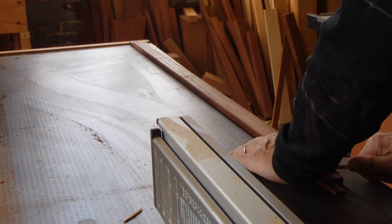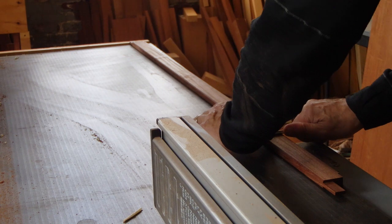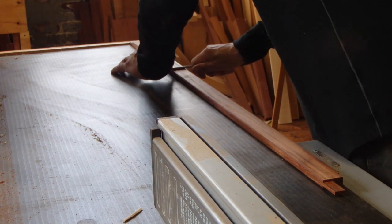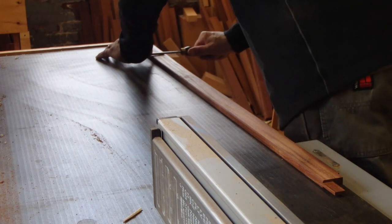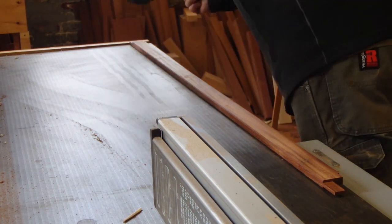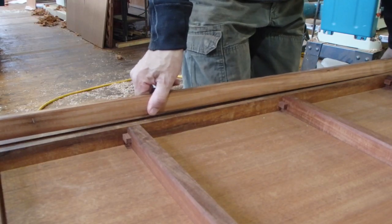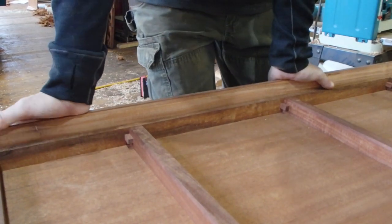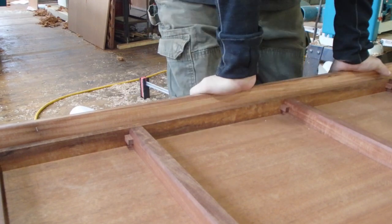One design change that was made during the build was the addition of this piece, which is a stiffener that goes across the front of the drawer bank just to keep its ability to resist sagging from items placed in the drawer to a very minimum. I used a technique of pre-compressing the grain prior to the fit in order to get a nice tight junction between the two parts.